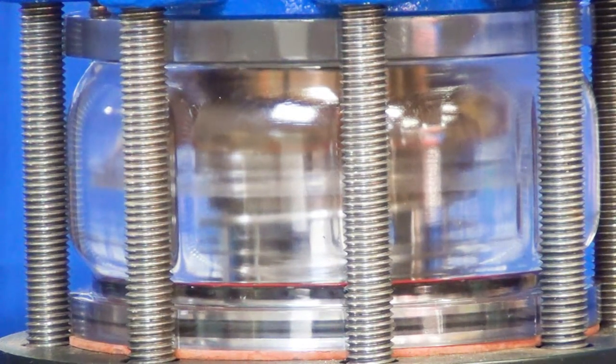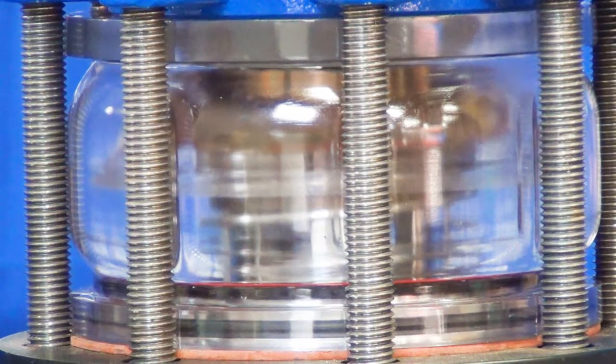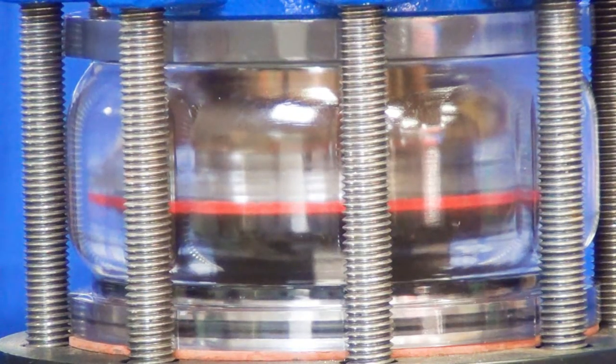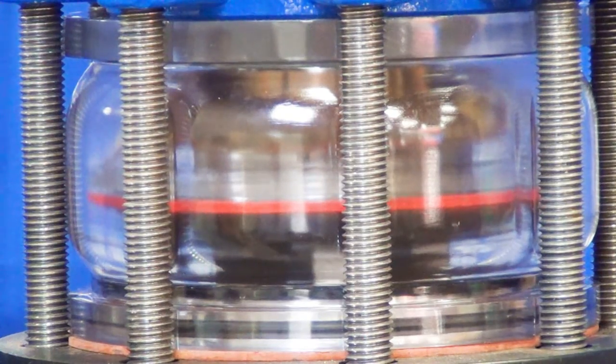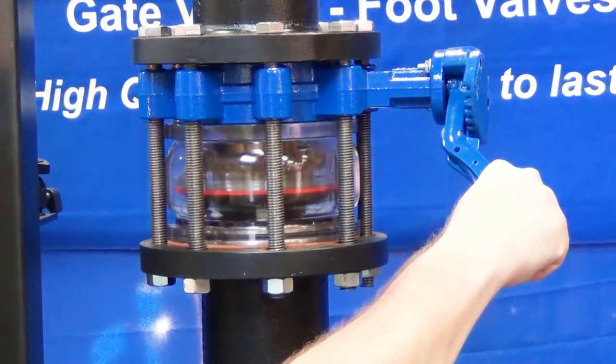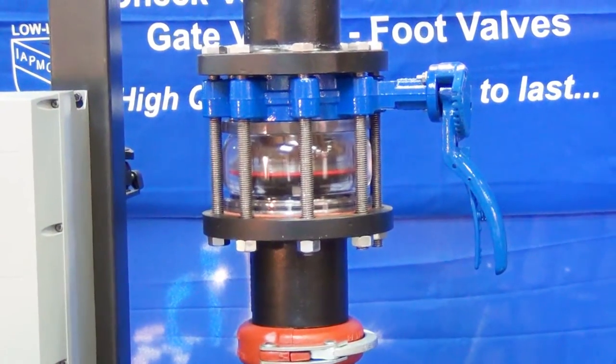Could you repeat that, Brian, so we can see how steady it is again? All right, we're going to go from stop flow up to 560 gallons per minute. Now you can see how steady that poppet is — at 535 gallons per minute climbing up to 560 gallons per minute. As you can see, you can operate the butterfly valve without interference.